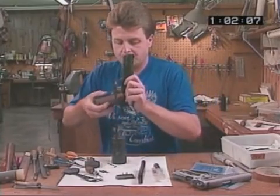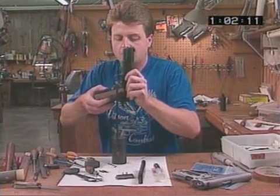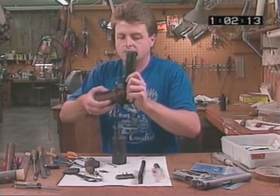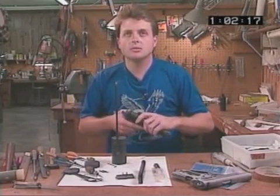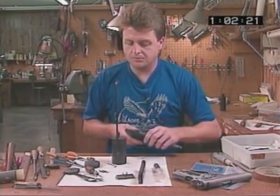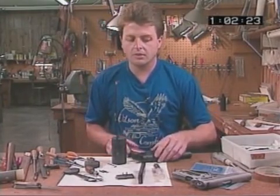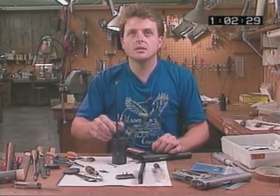So what you've got there is kind of in between a 3 1/4 and 3 1/2 pound trigger pull. Great. That's kind of where you want it to be for safety. For safety, you want to leave it at least 3 1/4 to around 4 pounds is what we like to set them at in the shop.